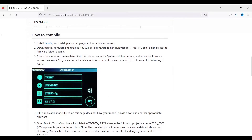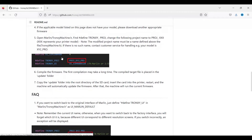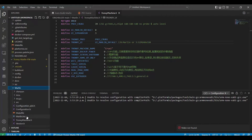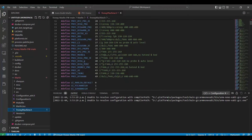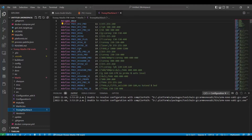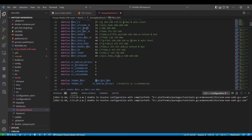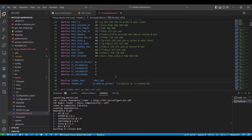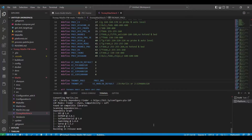It gives you step-by-step instructions on how to compile — you need to download VS Code. In your Marlin directory, you're going to go into Tronxy Machines and basically just go and define your printer from the list right here. Say you wanted the DL1 — you could just copy it and paste. Then you just want to go build and compile. It will build and compile your firmware, and that's it. It's as simple as that. They made it really easy and really straightforward.